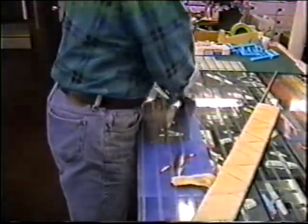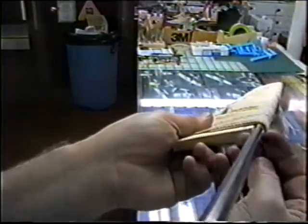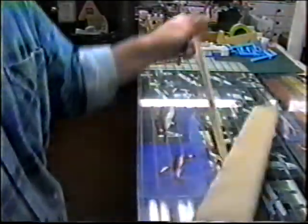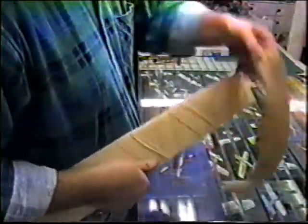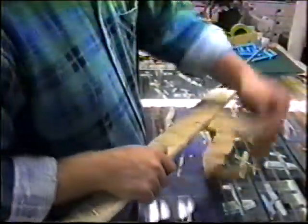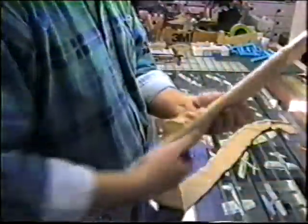The other way is, and there's no point even putting this on a video, we've done so much molding, is we've just taken a piece of 3/8 rod, put it in front of a piece of 3/8 wood, and in essence, just wrapped a piece of wood around it. Now, the reason for this is we're going to need a wrapped leading edge piece to make this tail the way I'd like. Again, if we had the Nomex, it just didn't happen, but that doesn't hold us back from possibly doing it in the future.